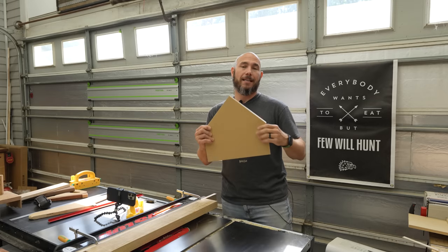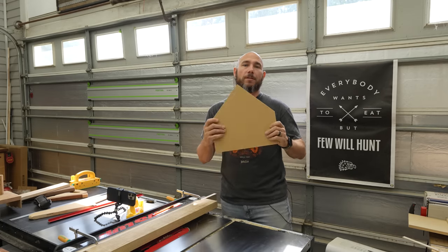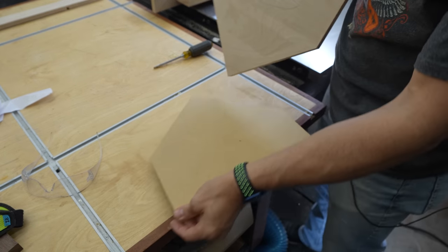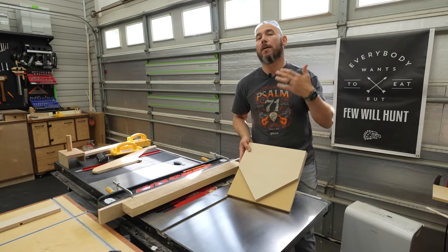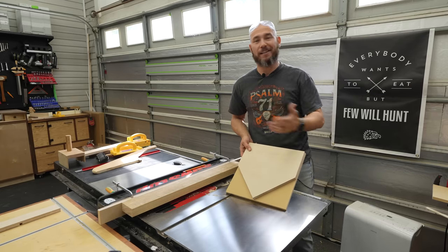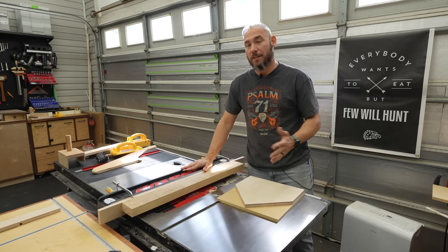That's why it's always best to get these pieces as close to the pattern as possible — about an eighth or a quarter inch oversized. Then from there, you just unstick your pattern. Once you have this set, all you have to do is tape the pattern on again to the next part and repeat over and over again. It'll help you batch out products at a speed you've never seen before, because you do not have to touch this fence once it's set.